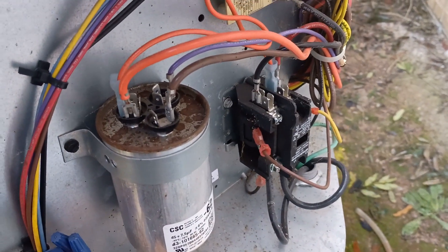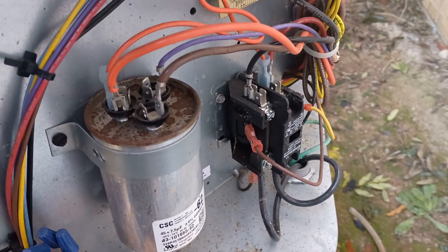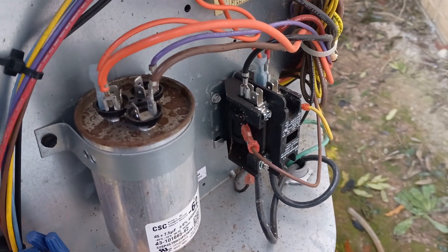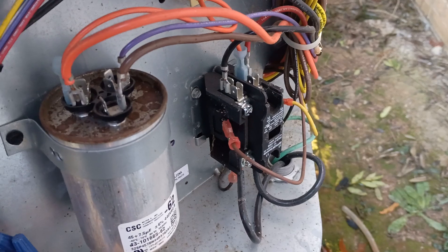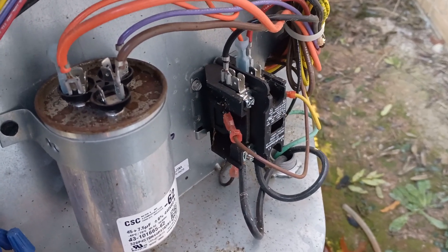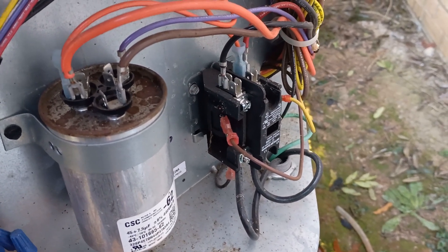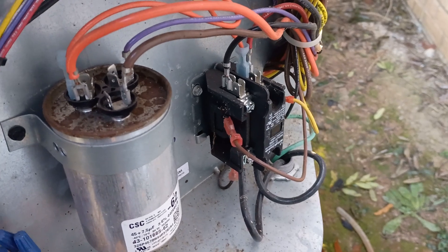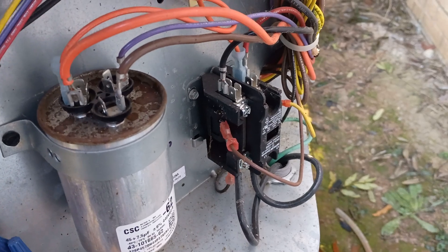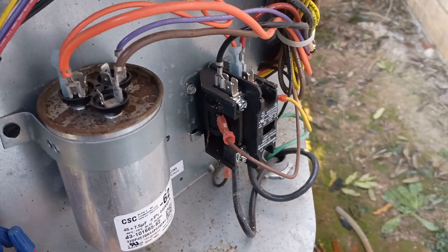The purpose for breaking a contactor in and out of defrost is to quiet things down and make it a little easier on the compressor. But you saw that it just broke that contactor for just a second and then came right back up. Now we're actually de-energized - remember, Rheem is one of the ones that we energize in heat. Did you see how quick that happened? That's not good, I don't like that.